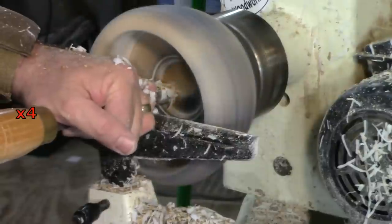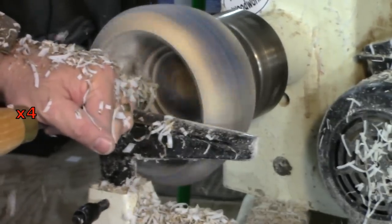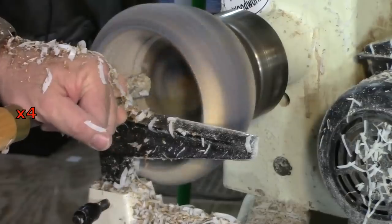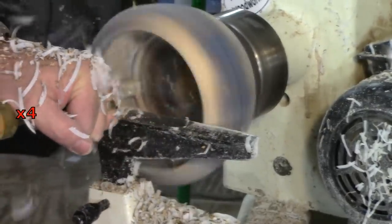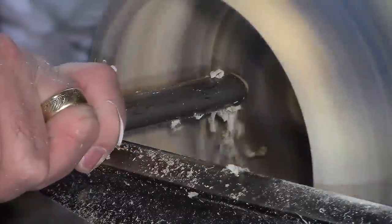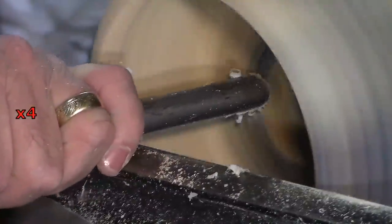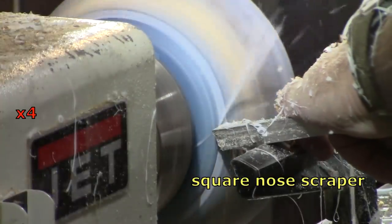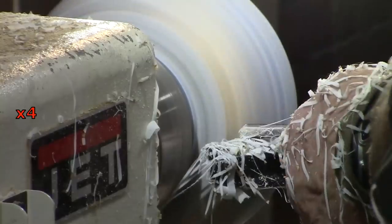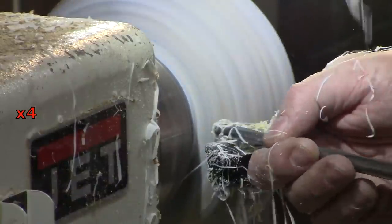In hollowing this bowl out, I decided to go with the square nose scraper and just kind of take it out a little bit at a time that way — it seemed to work out pretty good. I went back in with a bowl gouge to clean it up, first across the bottom and then up the sides. Getting towards the end of the process, I decided to reshape the bottom of the bowl a little bit, kind of round it out to match the top.